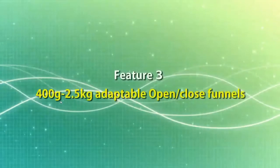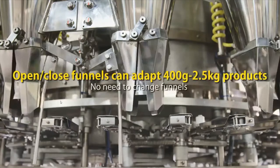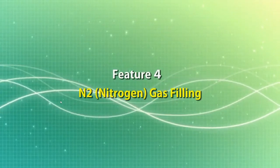That's a recipe-driven changeover, so each recipe that's registered can go from last good bag to first good bag within that 1-minute time frame. This is achieved by incorporating functions such as a dynamic funnel design, which allows for closing from a very small terminated gusset bag to a larger bag in bare fills.